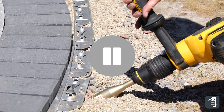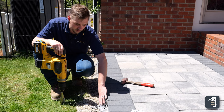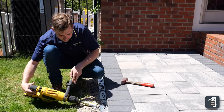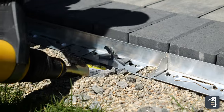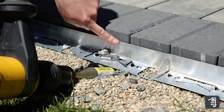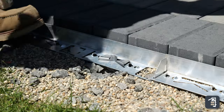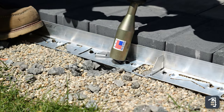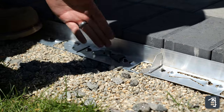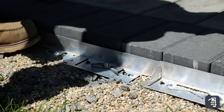Here's a great way to get this number 57 stone, number nine stone, back underneath where some of these edge stakes, when driving in, kind of undermined a little bit. Just take this hammer drill, put it on an angle like this — you don't want to go straight down. Drive that stone end into the stake, which is pushing it tighter to the edging. The other thing you can do is take these tabs — as long as you put that one side of the hammer drill, you can tap those tabs back down. That tilts them down, puts more pressure on the backside of this edging, pulling that hybrid edging tight.